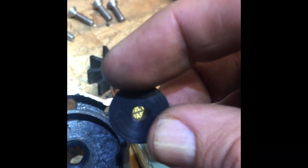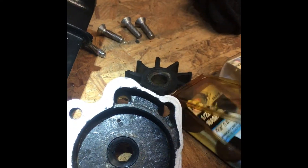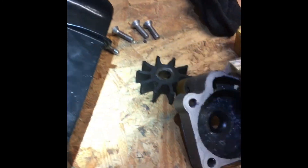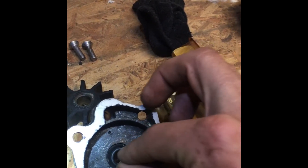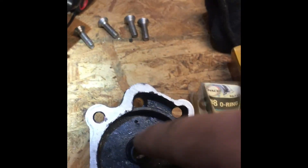I made that out of a flat washer. I took the flat washer — which is kind of thick, not like a regular o-ring — and made the hole just big enough to fit the shaft. You don't want to make it perfect; it can squeeze in there and the shaft will wear it in, which you can see happened. I shoved that in between the back of the front seal, the shaft, and the housing. Then I took an o-ring and stuck that right there. So now I've built essentially a stuffing box around this shaft.